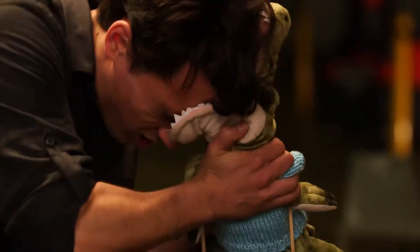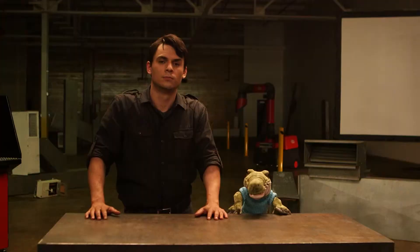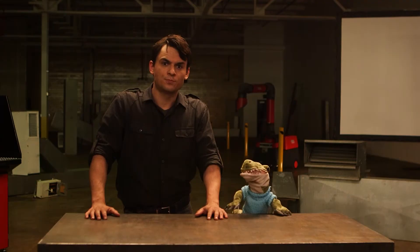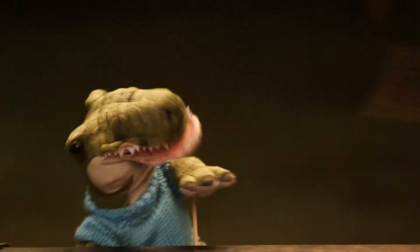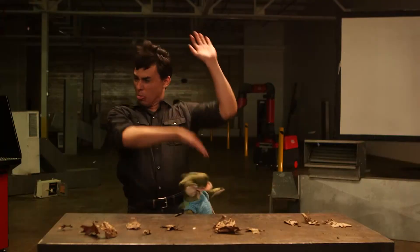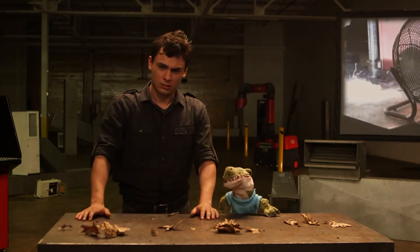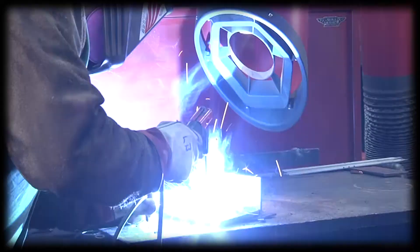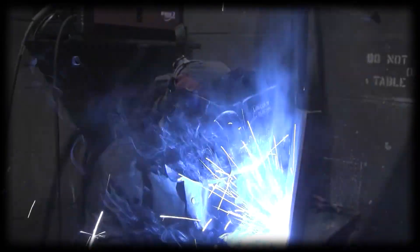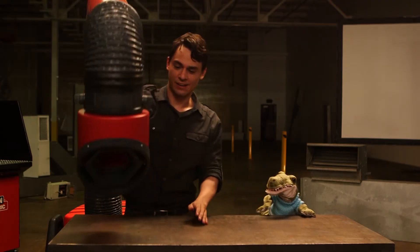Keep your head out of the plume. Furthermore, you must always ensure proper ventilation. The major types of ventilation are as follows: the first is natural ventilation — if you're outdoors, this would be wind; indoors, this would be windows and doors. The second type is mechanical ventilation, which would be fans. Finally, local exhaust sucks the fumes and gases away right at the source of welding.